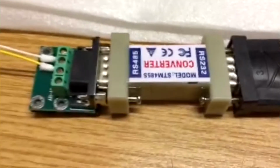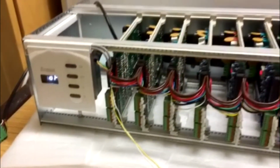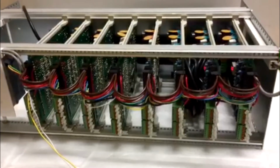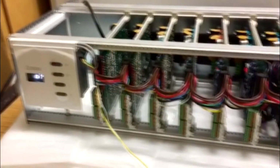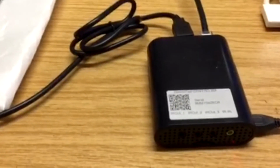And attached to the back, there is a USB to RS-232 cable. That cable then goes into a RS-232 to 485 converter, which then goes up to my test rack, connecting to the A and B terminals of the Futronix controller's RS-485 input. As you can see, the test rack here has 8 cards for simulating a Futronix PFX or EnviroScene dimmer, and just 1 control plate per master, on, off and so on. Or it could be programmed as required. That's just the basic setup, and that's all you really need to get the Centro 8M up and running.